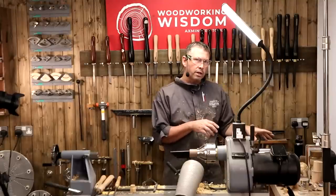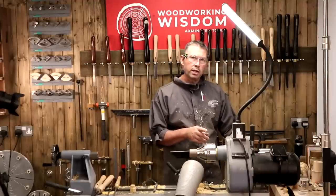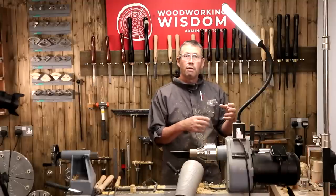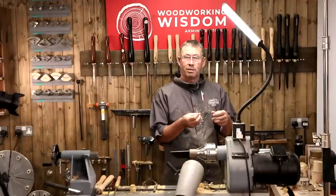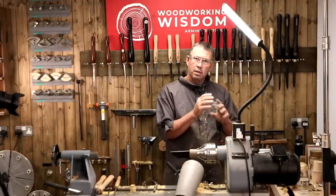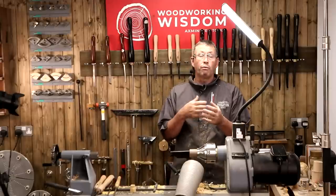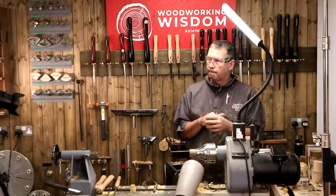So we've got very dense timbers here. Two reasons that I'm not trying to thread chase the beech is because of the movement. It's wet timber. It won't cut a thread. It will tear up badly, all those sorts of things. So we've gone dense timber, fully dried. And then we're confident then that thread is going to stay right. I think that answers James' question as well.